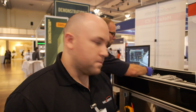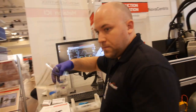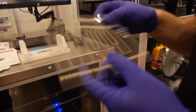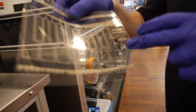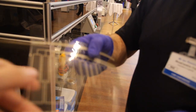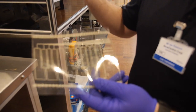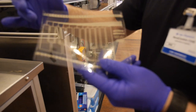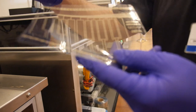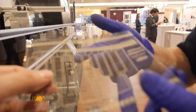So let's see an example of what's coming out. Here's what we were making in this case — this is just a piano. Each one is a little wire, and when I touch it, it changes the capacitance of that wire. Then I turn that signal into music. In the case of this, you have 12 channels, one for C, A, B, and so on. And of course I can play it when I connect it to a device.